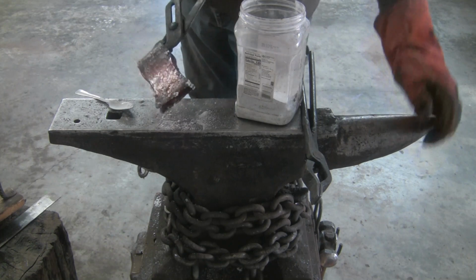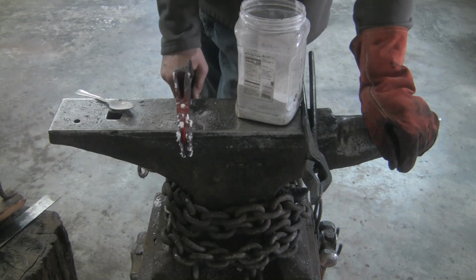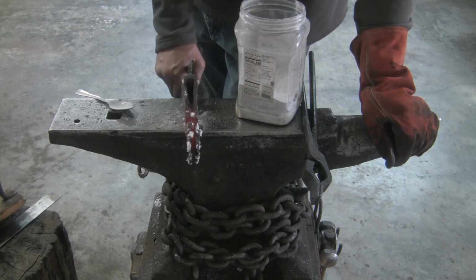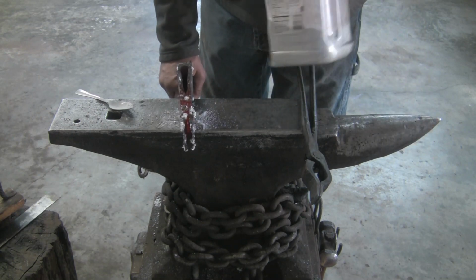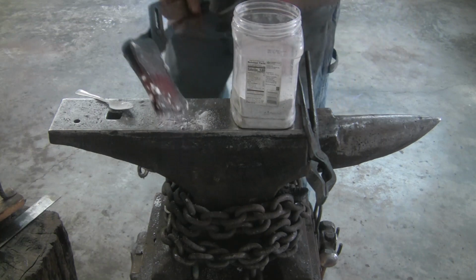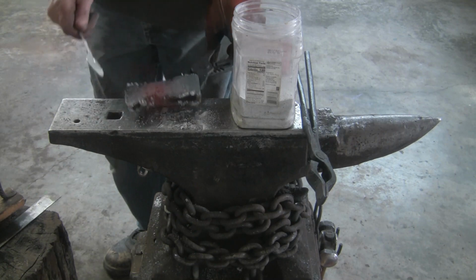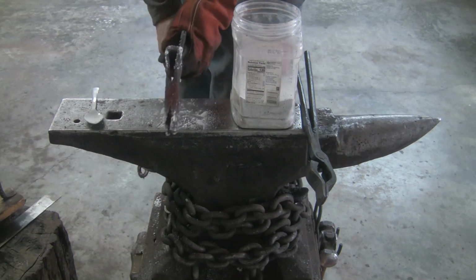welding surface. So if you're too cheap to buy the iron mountain flux like I am, just get a file and file some. You gotta clean it, make sure it's to a silver, and just take a file and get a whole bunch of shavings and throw them in there. I just kept adding shavings until it turned kind of a light gray color, like peanut butter melting. But all right, that's my little trick. Just take regular borax flux and get some high carbon metal shavings and mix in there until you get it to a nice light gray, and it actually works pretty good.